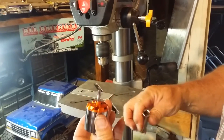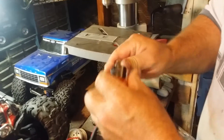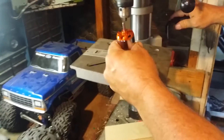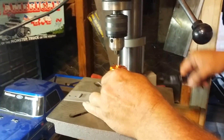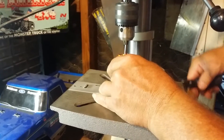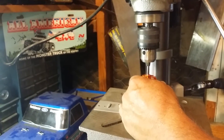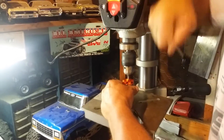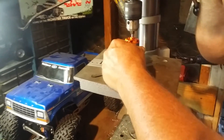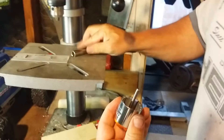I've been using my drill press and pushing this through to the other side. You don't have to use a drill press, but you've got to make sure you support that aluminum, and you can lightly tap it. We'll see if the drill press works again — I already used it earlier. That was uneventful, which is always good.